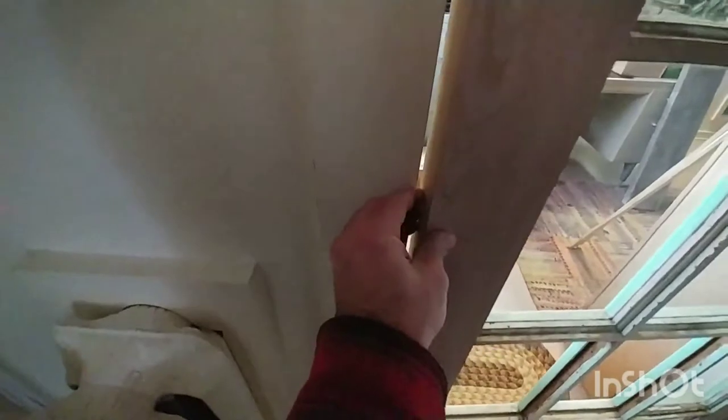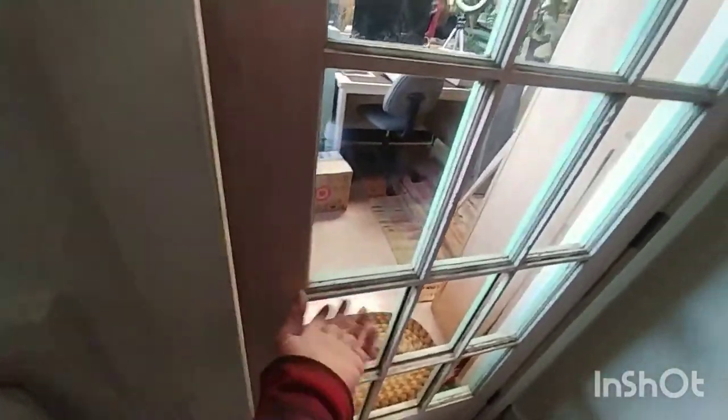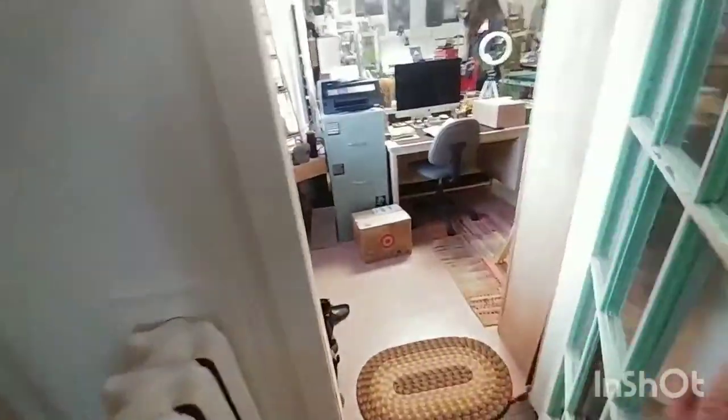We're looking for a consistent gap from 1/8 of an inch to 3/16 of an inch so that we have room to swing the corner of the door slab past the corner of the jamb as we rotate rather than moving straight. You need to clear that and overall clearances. That's about all you need. So, but, you know, you're familiar with the idea that you don't see that gap when it's all done being installed. Why is that?